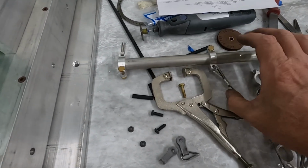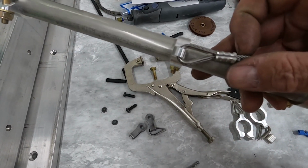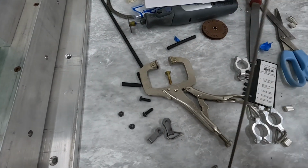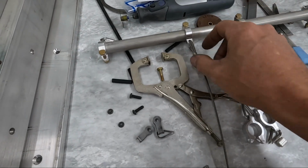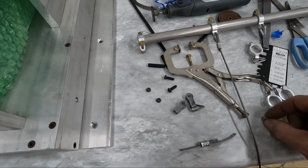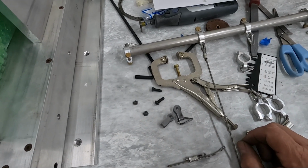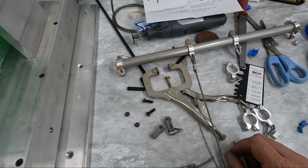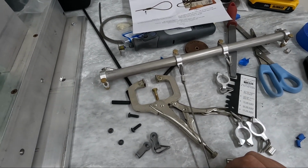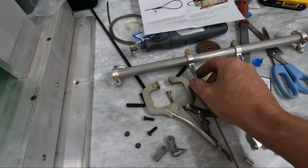I think it looks better with 3 because you can get 3 in there, but everything on the internet says I should just be doing 2. So I'm not really sure what to do now because, of course, I want it to be done correctly. I know you can actually weaken a cable if you put more crimps in the sleeve than are required, and you can actually weaken the fit. So I want to do it correct, but I can't figure out what correct is right now. I'm doing it correct according to their manual for this tool, but I'm not doing it correct according to any other thing I found on the internet for this size cable. So I'm really not sure what to do at this point.